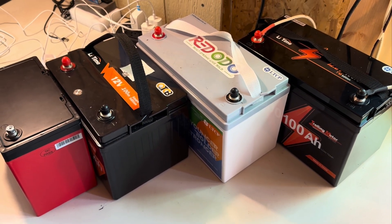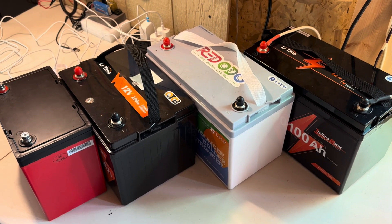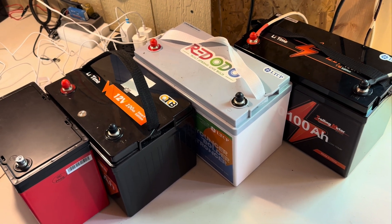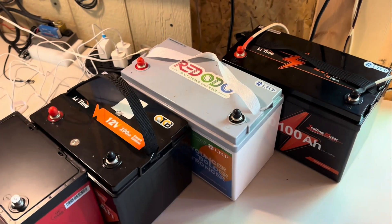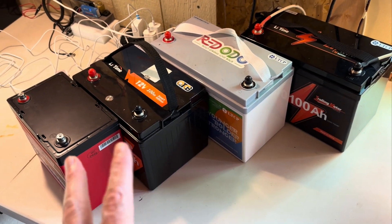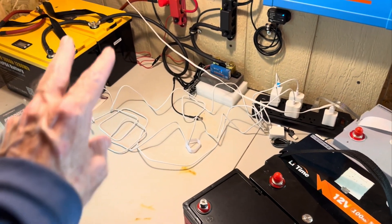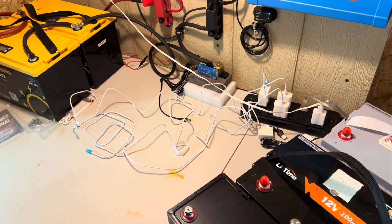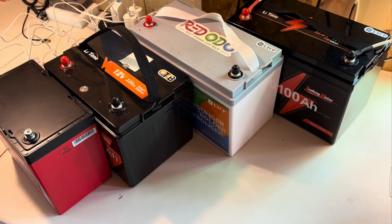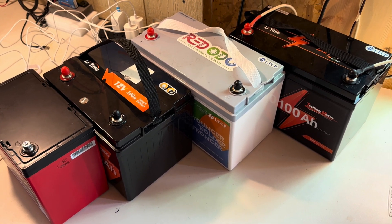What do you think — can I get away with that? That would be a 48-volt battery; never done that before. If anyone's done that, let me know. Or if it's a big no-no — the manufacturers are probably cringing at the idea of mismatching, since they never want you to mismatch even in parallel unless batteries are identical. Here I've got four 100 amp-hour lithium iron phosphate batteries. Yeah, that would make a 48-volt battery.